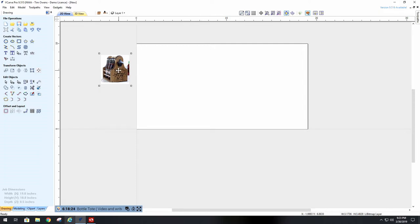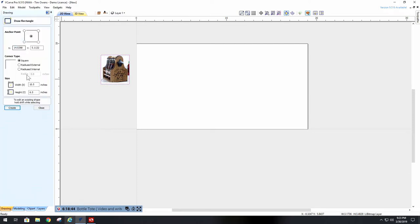So I'll look at it and ask, what basic shapes do I have? Well, the first thing is, if you look here, this is a rectangle. This is basically a circle up here, and it's basically two arcs right here fitting the two together. Then I figure out how tall I want this thing to be. So I'll make a square here, and I already know what I want it to be: 10.5 by 6.5. Or I'm sorry, 10.5 by 5.5. So that's the basic size of the rectangle.